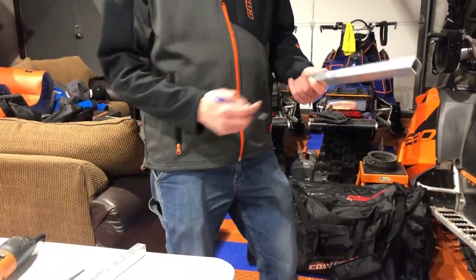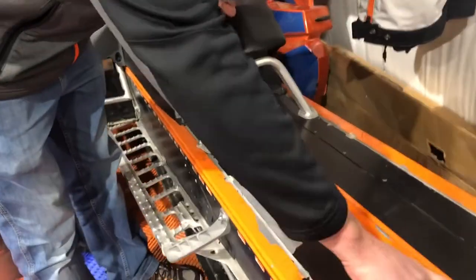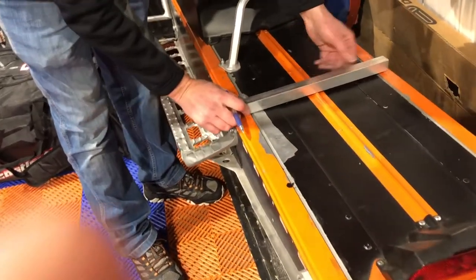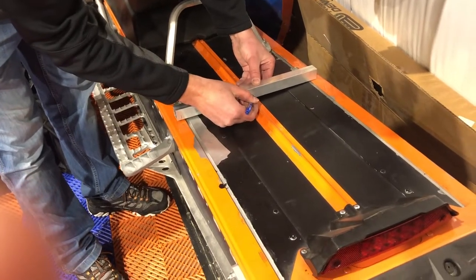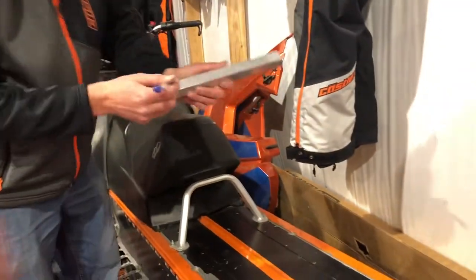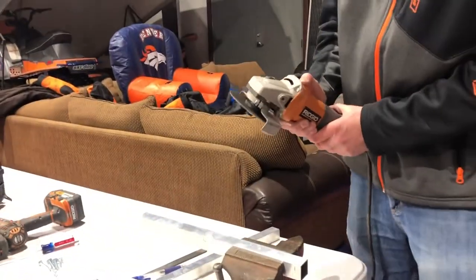The first thing you're going to do — this bar is where the light wire comes in. There's a little ridge right there, so we've got to set this down and notch this ridge out so it can sit flat. What we're going to do is draw a little line here and here, about that far, and we're going to notch that out with the grinder. So we're just going to take the grinder and notch this out.